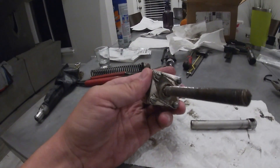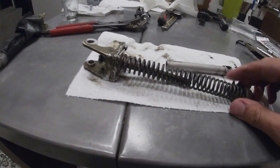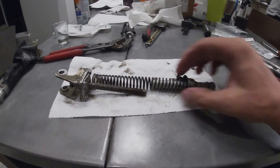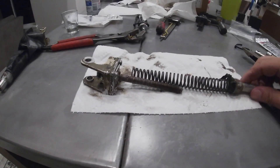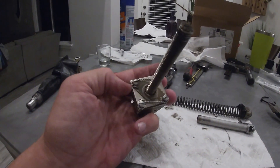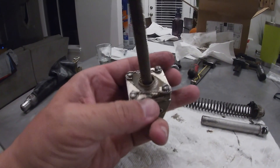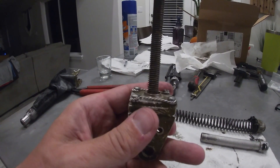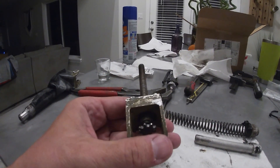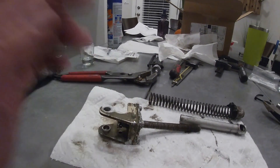When you take these apart, you'll want to take off the safety wire. First, when this spring is here on the inside, this unscrews — obviously takes the tension off of the big spring. Once you get that off, you slide it off and you're left with what we have in front of us. You'll pull off the safety wire, then take all these screws out and inspect them very carefully. Once you get that apart, you've got to press out the bearing on the inside. Let me get this apart and I'll show you what the rest of it looks like.